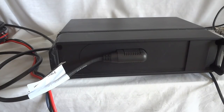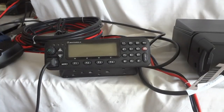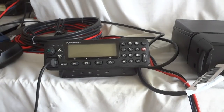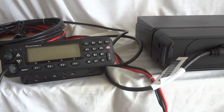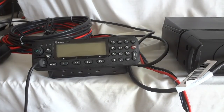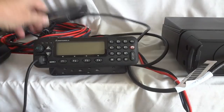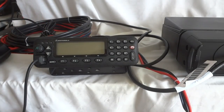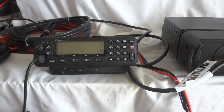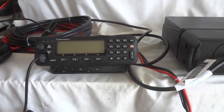This radio is also sold as a military radio — it's exactly the same radio but with a different color, army green. They've also been sold to the military, but this one was used for civilian applications. They're very popular with embassies, expeditions, Africa — you see those all-terrain vehicles with these long whips on them. Well, that's basically this radio. It allows you to communicate over large distances on the HF band anywhere you want with a relatively high power, with 20-foot interconnect cables between the car battery and the control unit.